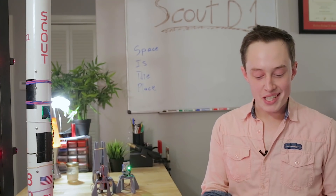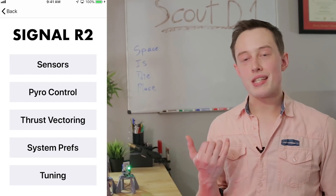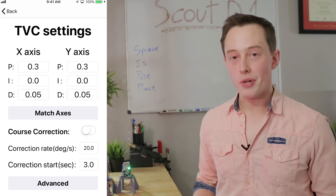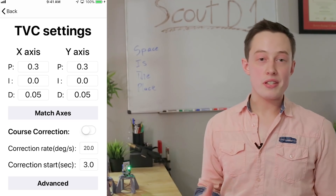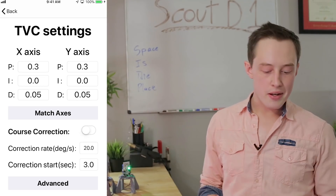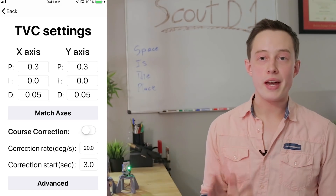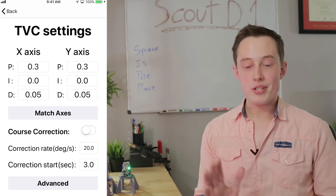Our flight profile is finished — once again we're going to reboot. I've connected to the computer with my phone. Instead of going into the sensors tab, we're going to go into the thrust vectoring tab. There's this little bit of text that says 'course correction.' What is course correction? Well, if the rocket launches at an angle, you might want to have it correct back to upright as it's ascending. This is helpful if you're launching on a windy day and you want to counteract that wind. So course correction fixes that. However, it's not turned on, which means that if you launch at an angle, Signal is going to try its best to hold that course — and it knows that angle because of those accelerometers on the launch pad.